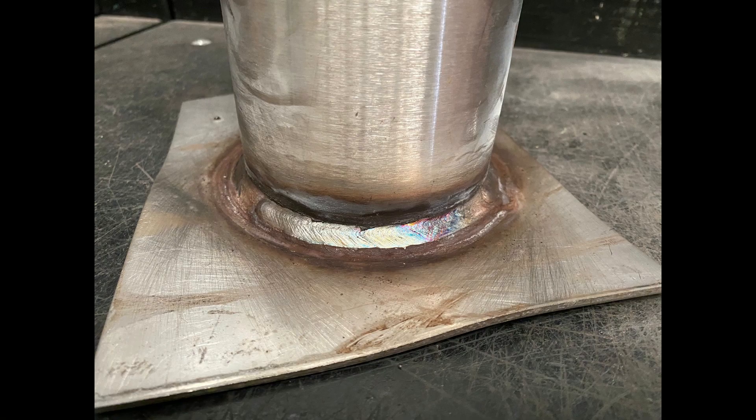To finish this three-run fill, we put our top run covering half of the bottom run and the edge of the pipe. Maintaining our angle, we drop it slightly lower than 45 degrees just to counteract gravity. And that's three runs done.